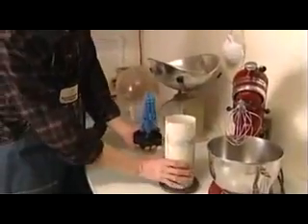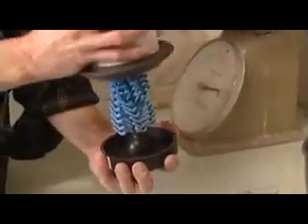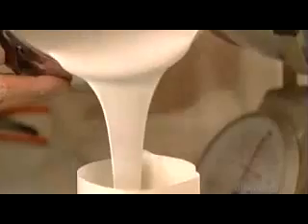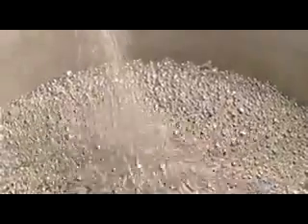They place the tree in a perforated steel flask, covered in masking tape. They pour in a liter of plaster, which hardens around the tree. Then they remove the tape and heat the flask. The wax melts through the holes, leaving plaster cavities in the shape of the key parts.